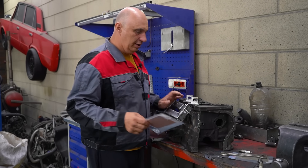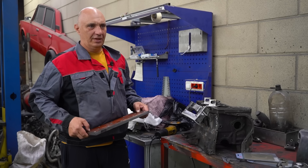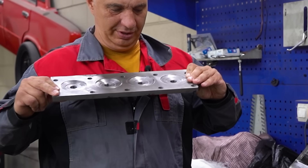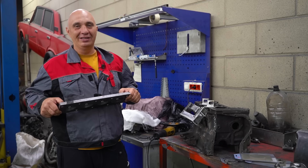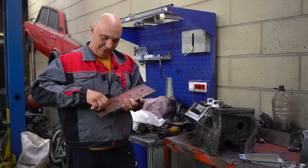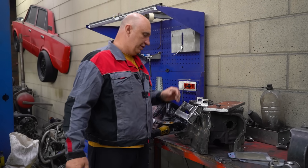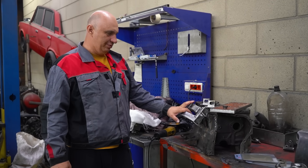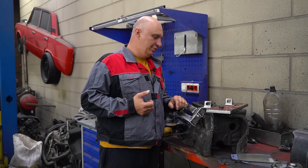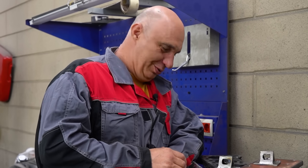You're probably aware that four- and two-stroke engines have very different sounds. We're in the process of putting together some housings — those are going to be the intake valves. For the valve to function, you obviously need some composite epoxy. As for what we'll be using as a cylinder head, the initial idea was to use a regular old cylinder head, but we decided that'd be boring, so we'll be using this — just a regular old metal plate that doesn't have any valves, to hammer home that this is indeed a two-stroke engine. We've got bungs that'll allow fitting the spark plugs. Just the bare minimum of welding in order to prevent warping it, though something might have already slightly shifted while we were welding. Arc welding does mean a lot of heat — things are going to move around and there's really not much you can do about it.